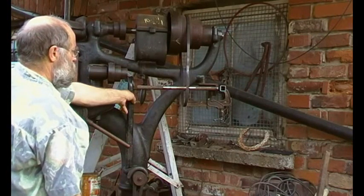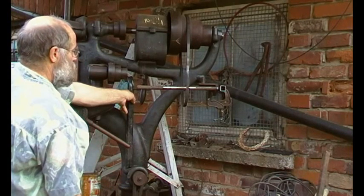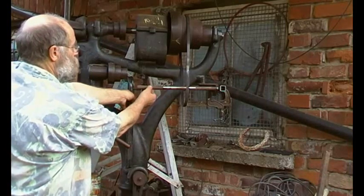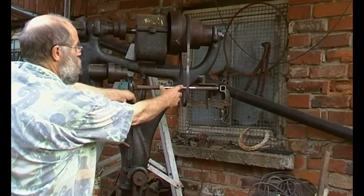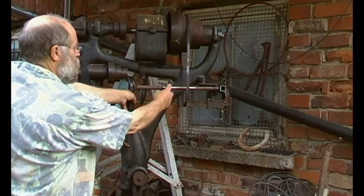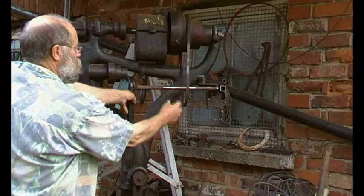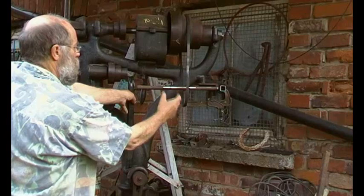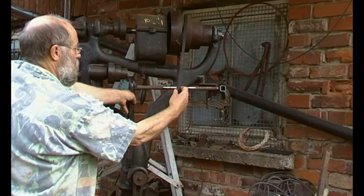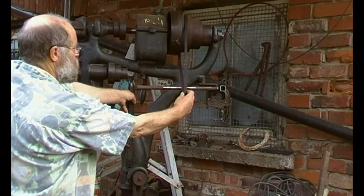It's not like mega heavy duty, far too big as far as the scale of the machine is considered. So then, that piece of box section - that inch box section - will sit on here, and we can build a motor mount off that. Which is effectively four pieces of lightweight inch angle iron making two channels, and then the motor will bolt onto that. That will go about there. Hopefully, let's make it up, see what happens.